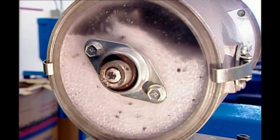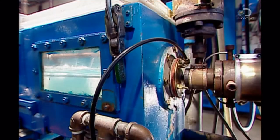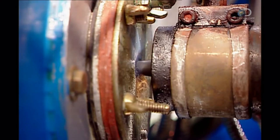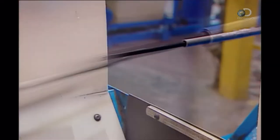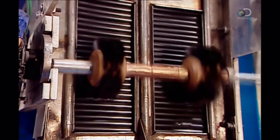This factory also uses polypropylene pellets to make straws. The black beads are pigments to colour the plastic. An extruder melts the pellets, then forces the molten plastic through a circle-shaped die. As the long, continuous straw leaves the extruder, it cools and hardens in a tank of chilled water. The giant straw is then cut with a knife into individual straws, which fall onto a conveyor belt and are transported to the packaging line.